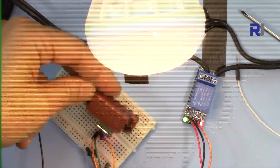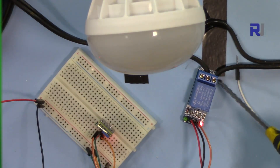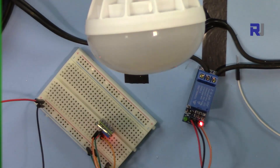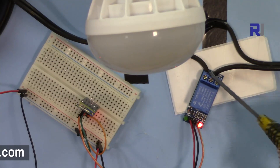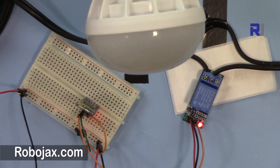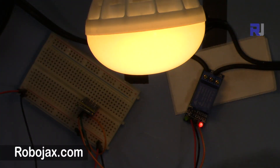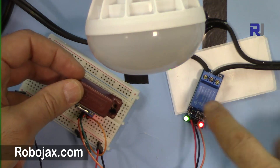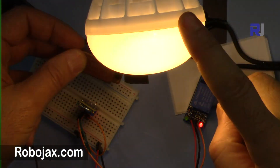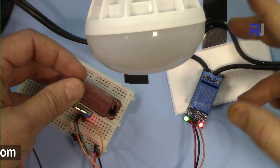So the light is on when the magnet is close, and off when it's away. If you want to do the reverse, just remove this wire from the normally-open terminal and put it in the normally-closed terminal — it will be the opposite. Now I've connected the wire the opposite way, so the light is on by default. When I bring the magnet close — like closing a door — the light goes off.